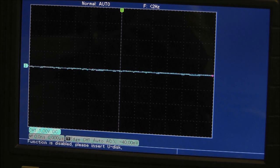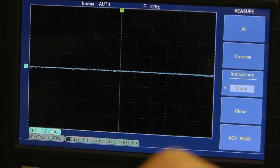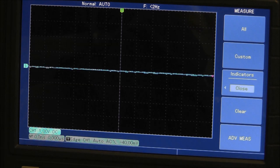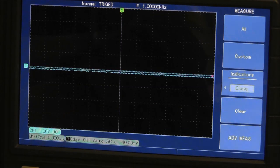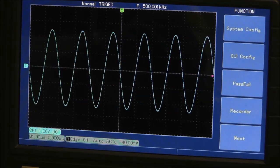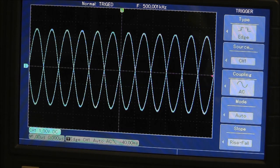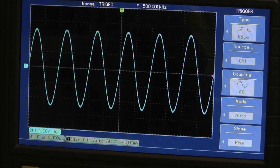There's a menu on/off button that just turns the menu on and off. A lot of people were concerned about the screen size — this blank spot is always here, measurements are always here, and the status info is always at the top. I'm going to hook up the signal generator quickly so we have a signal going. I'll set it at 500 kilohertz.